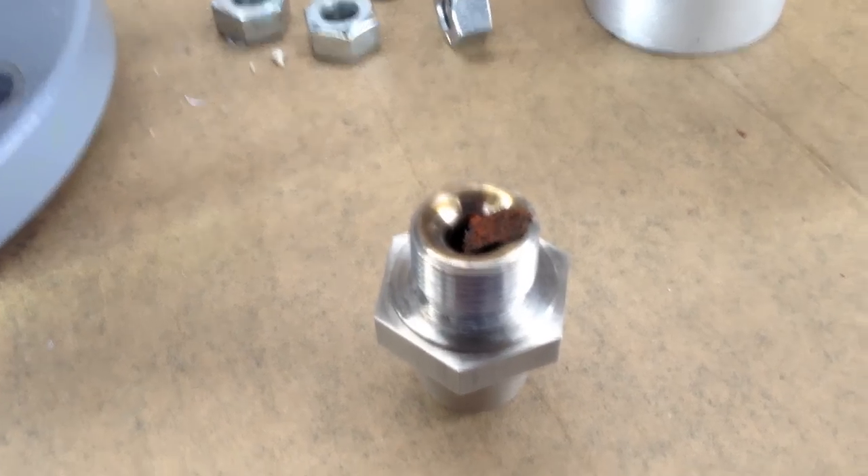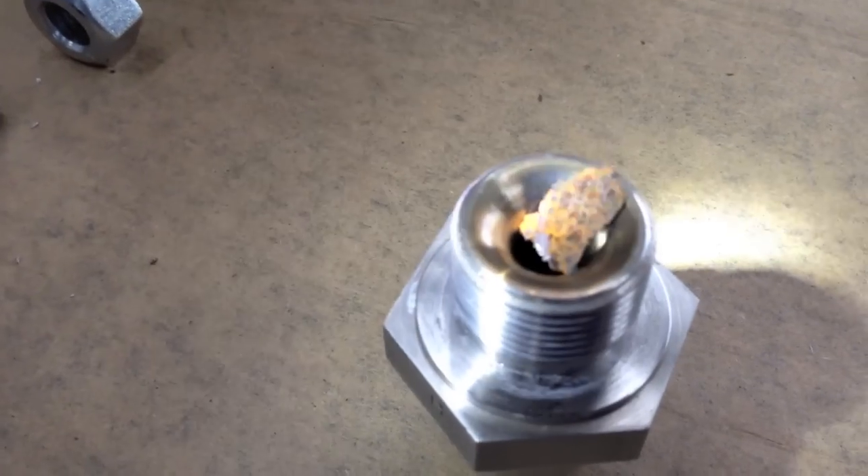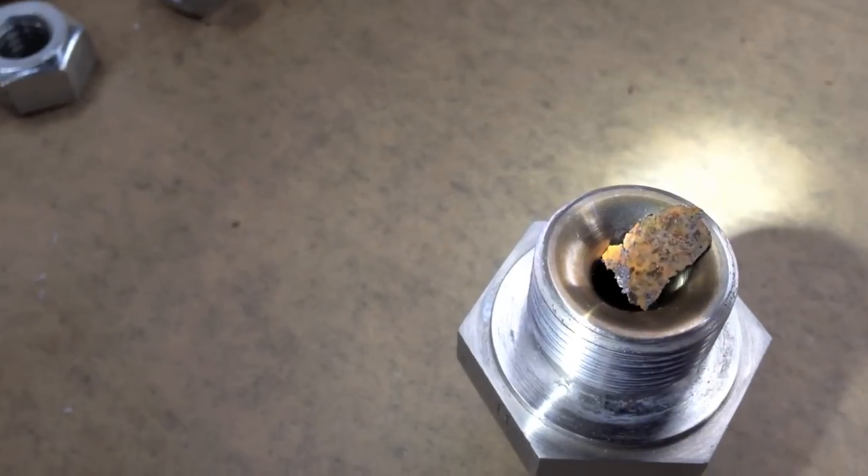It is important on a startup to blow down the steam lines before the steam ejector so that all debris and rust inside the pipe can be removed before it can get stuck inside the steam ejector nozzle. The rust will block the orifice of the steam nozzle, preventing good flow of steam through it and thus harm the performance of the ejector. It is always important to remove this rust, and to do so you have to remove the steam nozzle from the steam chest.